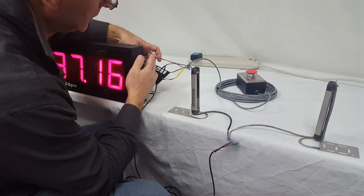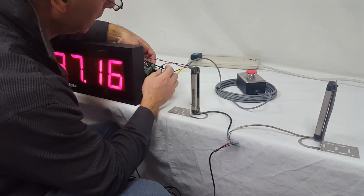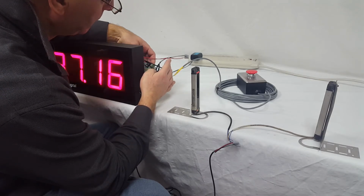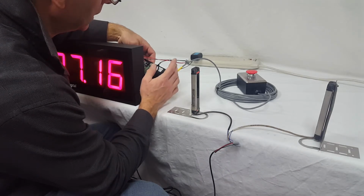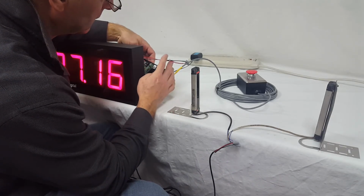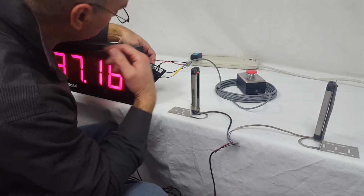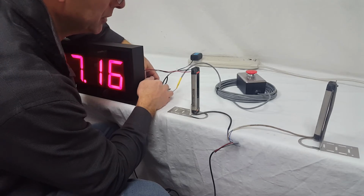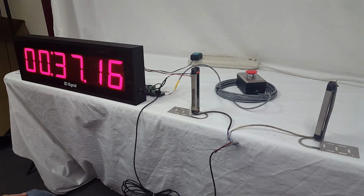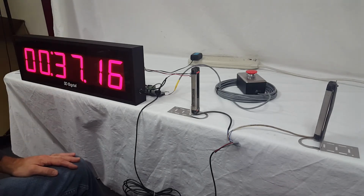We provided sensor power since we knew that they were connecting to a sensor and they wanted that all in one package. So sensor power is plus or minus 12 to 24 volts DC, red and black, and then we have another wire for the sensor trigger. This is kind of a custom thing, but not really. This is pretty standard for us, this 406 term.